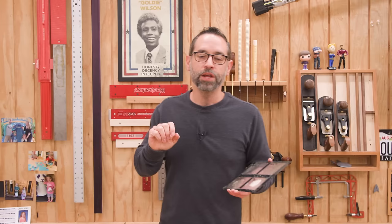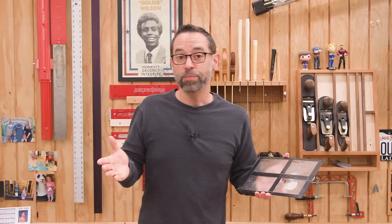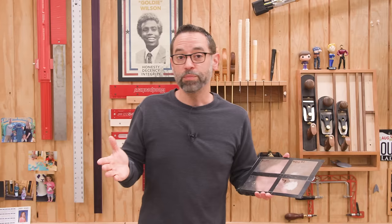I'm going to be using the citrus solvent with two of our finishes to help dilute them and get the best out of the finish. Look it up for yourself, check what the FDA says about it, and make a decision if it's right for you. The first test I wanted to run has to do with drying. Oils can be classified as either drying or non-drying — that's literal. Either the oil dries or it always stays wet, and that's going to be an important factor. To test this, I put a few drops of each oil onto a piece of plexiglass, spread it around for good oxygen contact so that any curing oil could cure, and let it sit. I only planned on a few days, but with house shopping and packing it ended up being a couple of weeks.